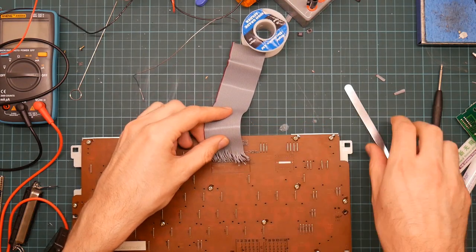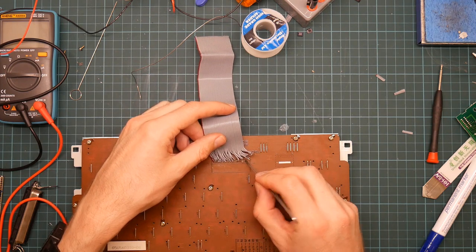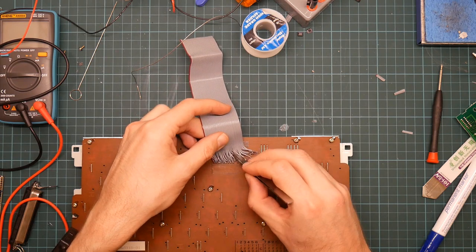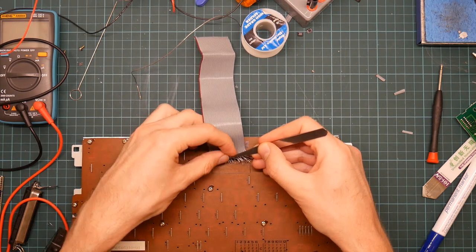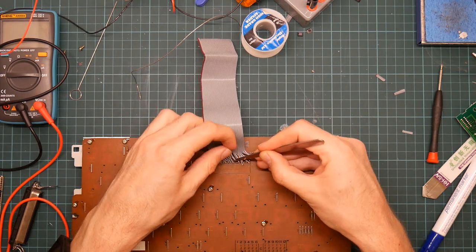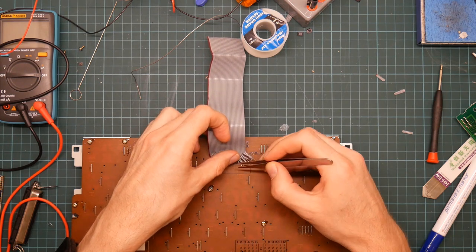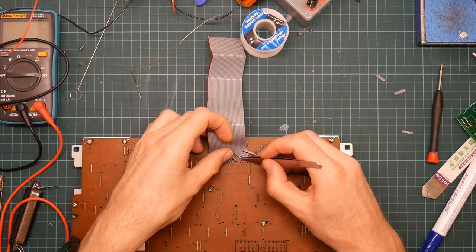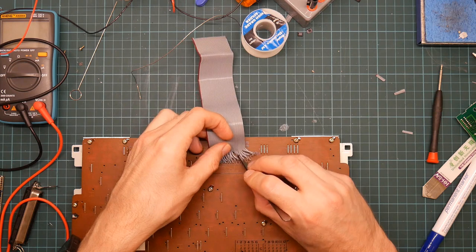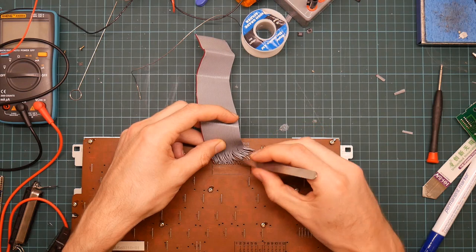Now, I traced some of the board earlier, and I know that the pins down this end drive the LCD, and the pins up this end are mostly the keyboard matrix. Thankfully, the microcontroller doesn't care. Its pins are almost completely remappable. It does have a built-in I2C SPI controller, which likes a particular set of pins, but frankly, come on, I'm not going to be using it.